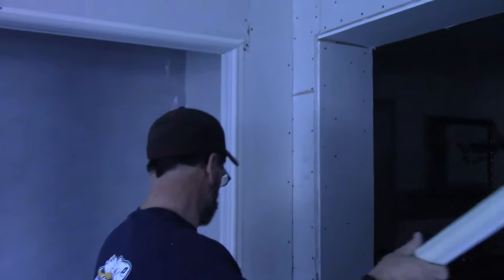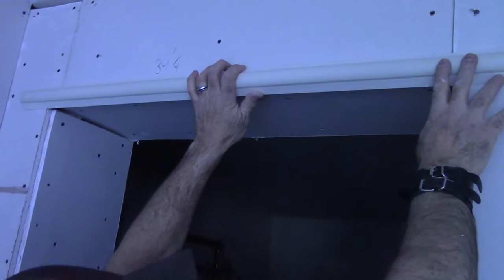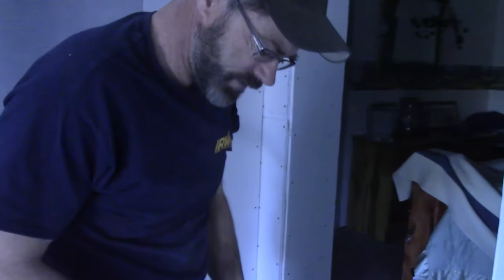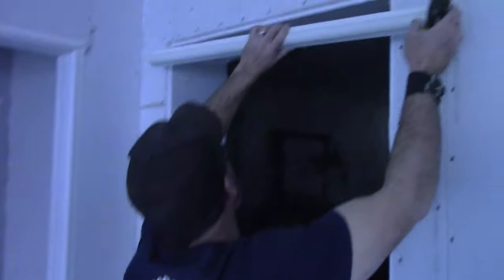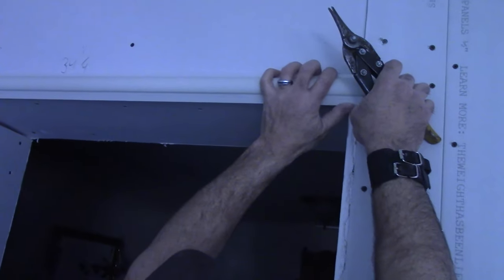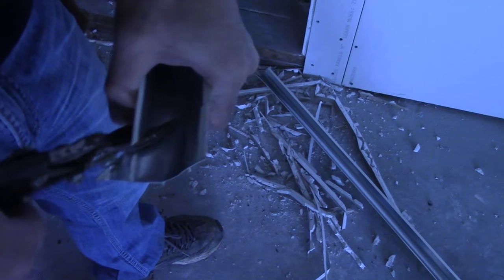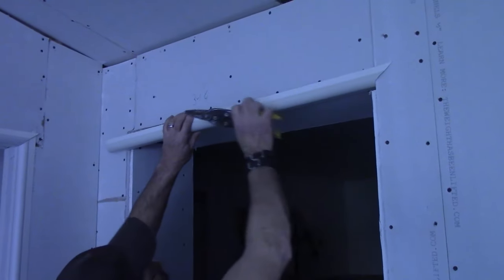This is how you do it. You're going to take your bullnose and do the top piece first, because these pieces are going to come up to it instead of cutting in between two finished pieces. So you're going to run this past and run this one past, and go ahead and cut that length — like so. Then you can put that back up there and use your thumb to mark that, and go in like so. If it's on the right side, you can come in and then do this — you're going to 45 that, like so.